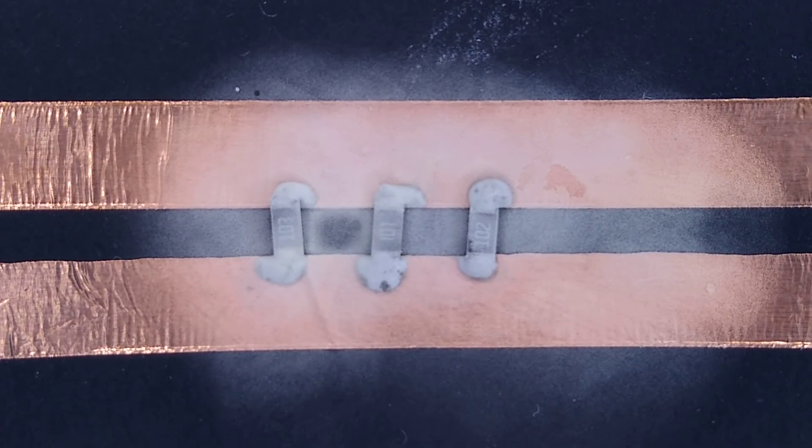Here is the test setup: I have a 1k resistor, a 10k resistor, and a 100 ohm resistor, and one of those is about to start overheating. That's very vivid. It's basically remelting the flux, and the component that is faulty — the one that is getting hot — announces itself by going jet black. Isn't that neat? In the case of a capacitor it would go clear, but you can see a very distinct change.